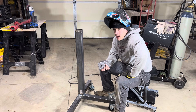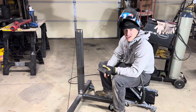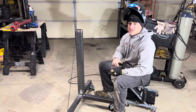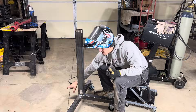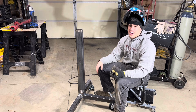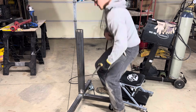So instead of it being 38 inches, it's now 33. We're going to get this tacked into place but not finish-welded yet because I'm not 100% sure if I want to keep it this way. I also decided I'm most likely going to get another piece of tubing, six to eight inches or so, and put it on the backside because this can tip pretty easily. I'd rather play it safe, so I'm probably going to add another piece of tubing for stability.